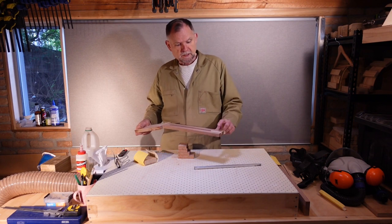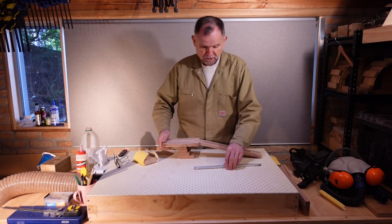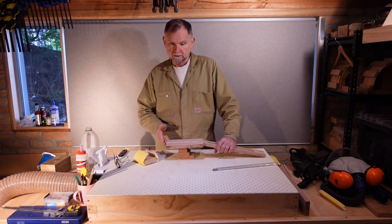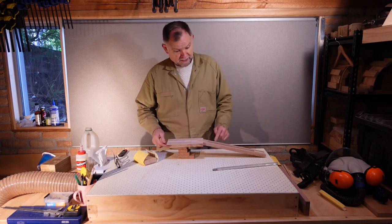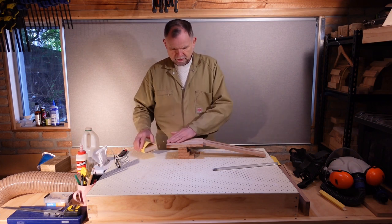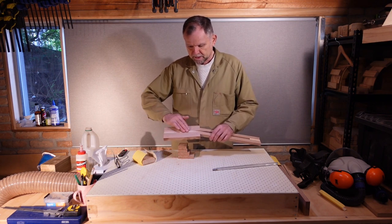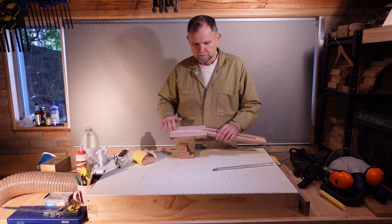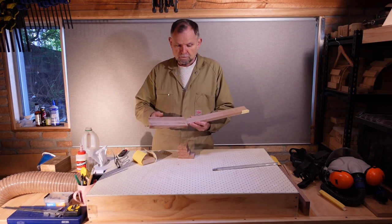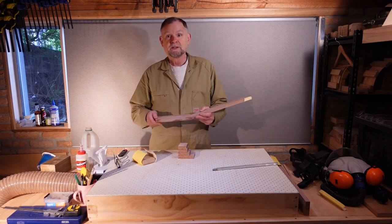Off camera, I cut a small piece of wood to fill in the truss rod channel up at the heel end, but we're not gluing that in yet because the position of the truss rod is still to be determined. I have also squared off the end of the headstock, paying attention to the fact that this edge was parallel with the neck and this edge was not, and I've just been smoothing over the transitions on the headstock. This will be covered but it is perfectly flat now — I can't feel any edges. What we're going to be doing now is thinning the headstock from the back and also forming the start of the volute, and for that we're going to be using the drum sander in a way that we seldom use it.